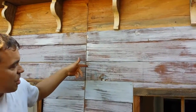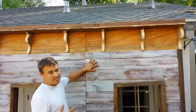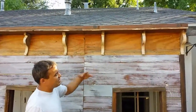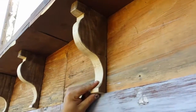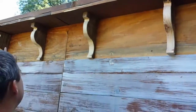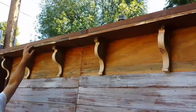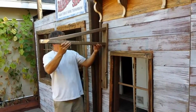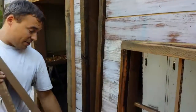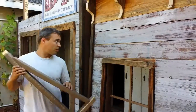When we shot these on, that's actually the only place the siding is attached — we just shot it once, twice, three times. That's good because when we want to rip this thing apart or make any changes, it's easy to take off. These corbels up here are a really simple design — we cut some two-by-six, made one as a pattern, and then made several of them. We still have to age and paint them. I added this little lip to give it a thicker look. The mount will go like so — I'm going to pre-drill this and put some pressure blocks on the back side for a stronger connection.